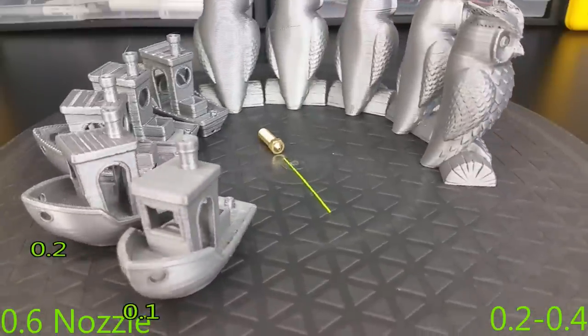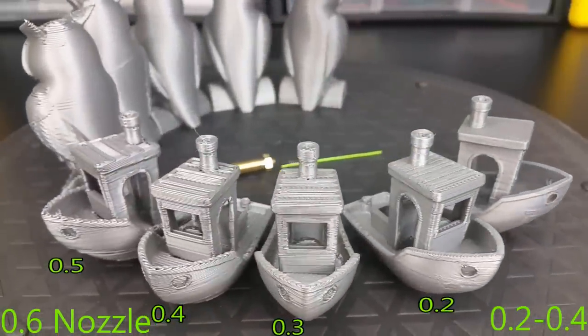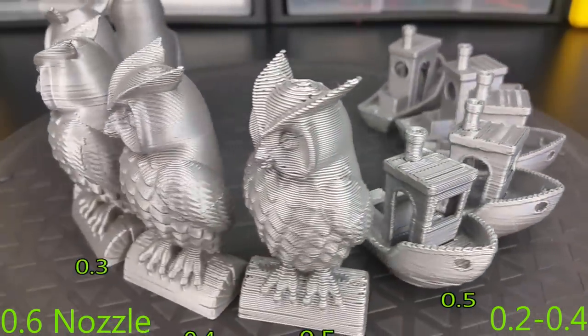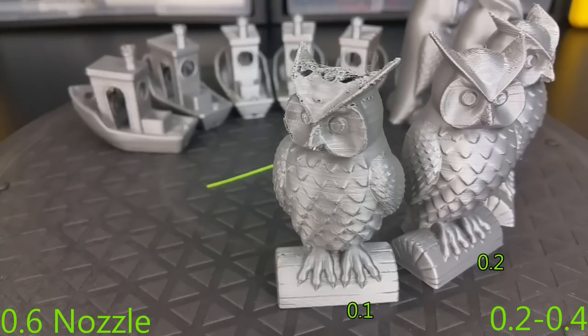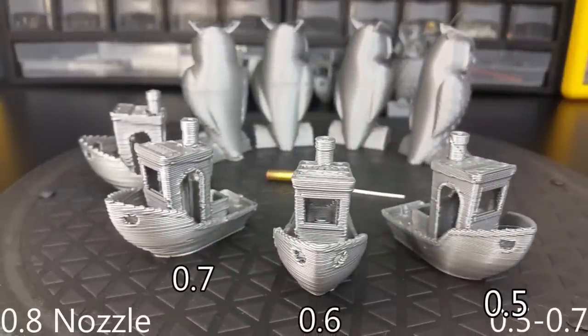Now I want to show you how each nozzle has a range of layer thicknesses it can print with. I have spent a lot of time playing with printer settings just to figure out where the limits of each nozzle are. Just as with all 3D printing examples, what I'm showing you is a guide to help you figure out what works best with your specific printer — what I consider optimum may not work best for you, but it should get you close so you don't have to start from scratch. The 0.6 millimeter nozzle can print layers from 0.1 to 0.5 millimeters high while obeying the layer width-to-height ratio never-going-below-1.2 rule. I found that prints with 0.1 layers had inconsistent perimeter surface finish and 0.5 layers had a hard time putting down enough material — gaps were visible. My recommendations are to use the 0.6 nozzle for 0.2 to 0.4 millimeter layers. Anything bigger, switch to a bigger nozzle.